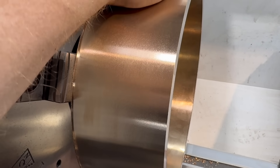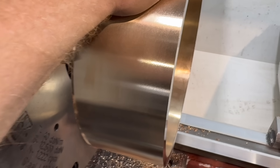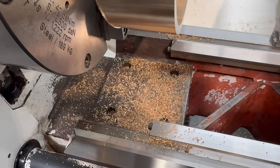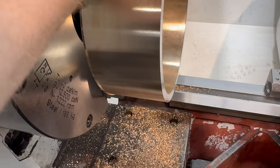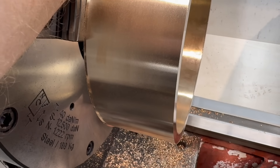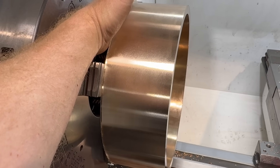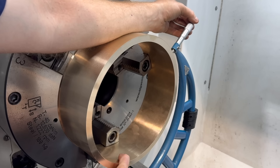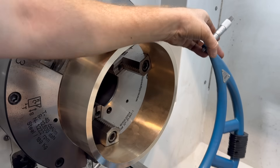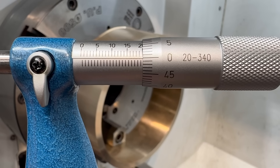I've let it cool down slightly. I don't machine bronze with coolant — it just makes a terrible mess and gets stuck in the coolant tank. So I just let it cool between passes when I'm checking and between the final pass, but it's fine. We'll see what that measures up at now — it should be 320. Lovely, let's get this machined.